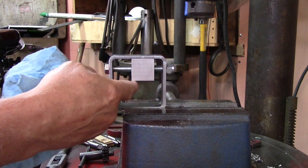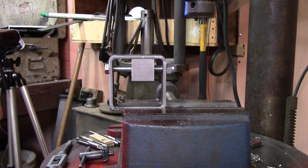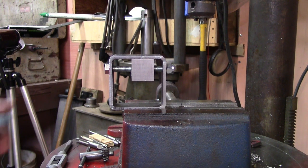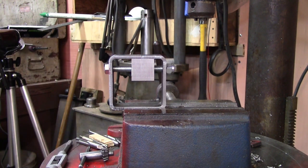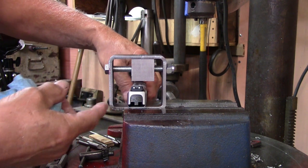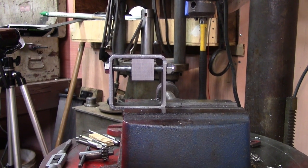Now then, I need to come down and mill this part to have the little pusher section hanging down. And I need to bring the width back just a little bit so that it doesn't hang out on either side of that guy there. So I suppose we're up to milling that part. And then I'll have to come up with the little blocks that go down in here so that they'll be on either side of the slide. That'll fit in here like this, and I'll have to set it up on a block to make it work. All right, so back to sleep, and I'll bring you around to look at it again in a minute.